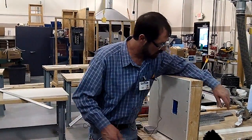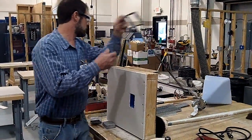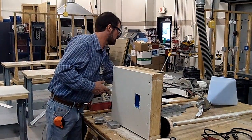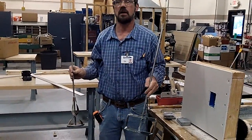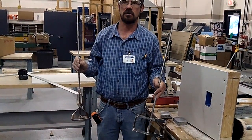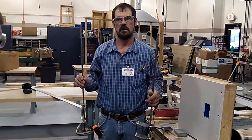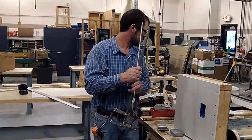Back to this stuff — they showed you the mud mixers the other day. There are two types and both fit in a drill to mix your drywall mud. We'll go over that once we get to the mudding and finishing stage. But what happens when you mix too much? Air bubbles in your mud, which is going to cause air bubbles in your finish — not good. This causes you more work. So remember, we don't want to over-mix.